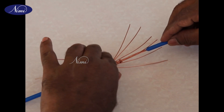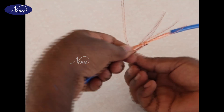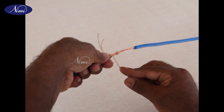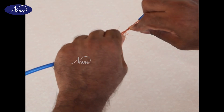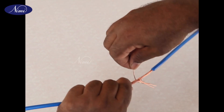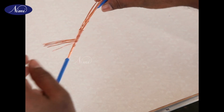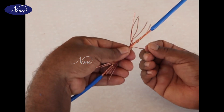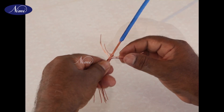Step 8: Hold one of the cables in one hand and twist the strands of the other cable end over it. Twist one by one, closely and tightly. In doing so, each strand has to be twisted half a turn at a time. Twist the strands of the other cable one by one. The direction to twist from the shoulder should be the same as the cable's original twist direction.